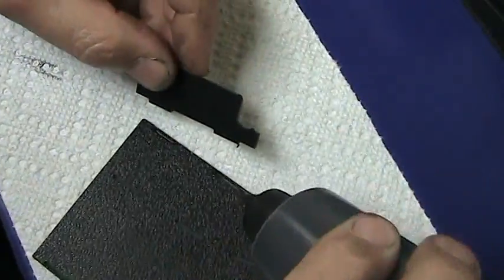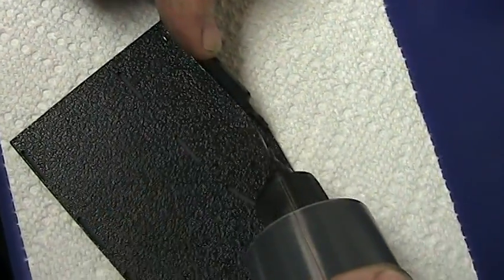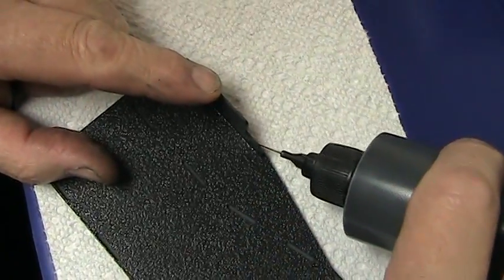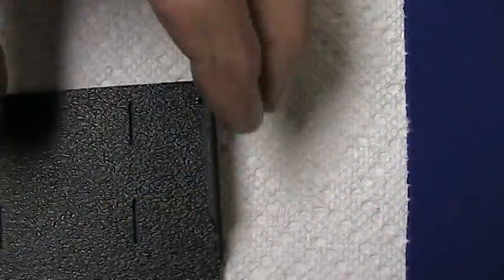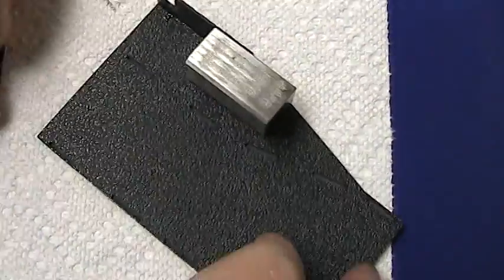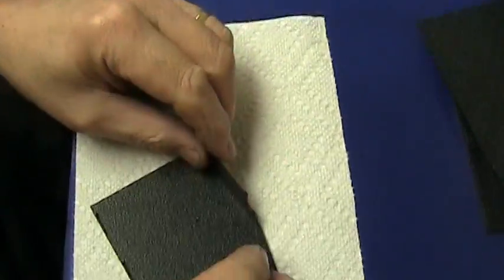We're starting with just putting the corner piece in, then our one end piece. Putting our glue down, putting a fillet on either side. The MEK attacks the ABS very quickly — just get a little squiggle to make it sit in, and put a block in there to let it dry. Let that sit with the block holding it square as we start on another one.